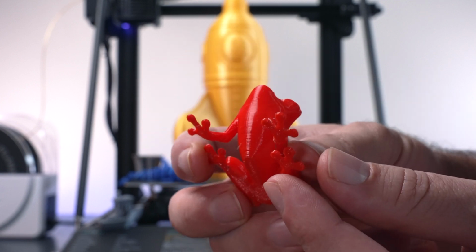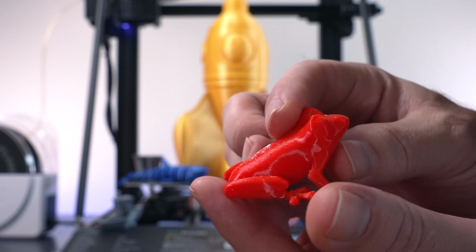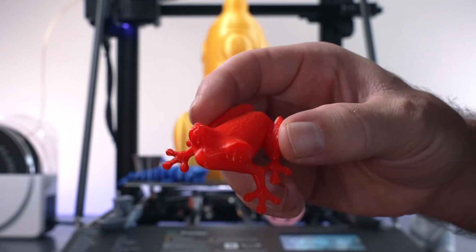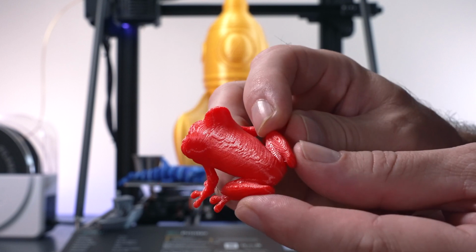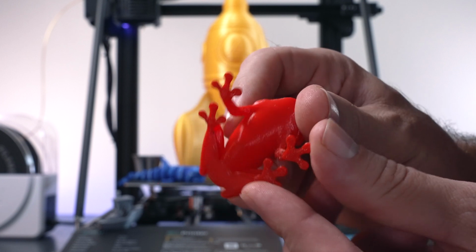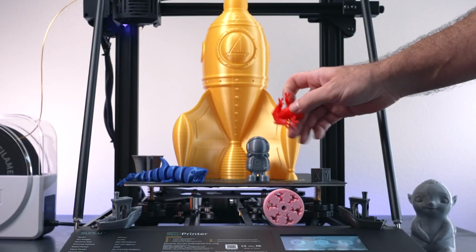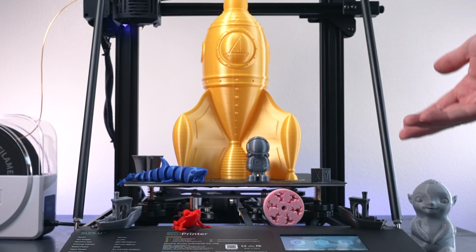This printer did an excellent job putting the layers down, and just very accurate and great adhesion, no stringing. And by the way, I did turn the retractions down to 5.5 and that seems to work just as good. So our Z seam here is on top, you guys can see that. Yeah, other than that, very nice, and all the prints stick to the bed very well. I'm very happy with this build platform. It's very easy to use and very friendly, and everything sticks and comes right off.